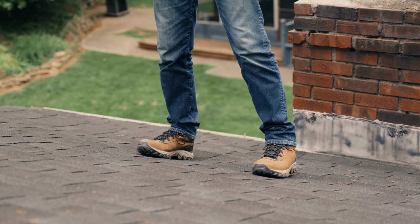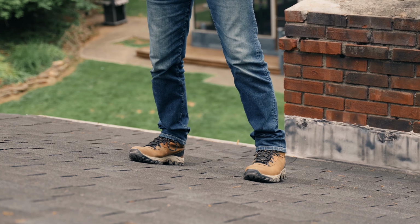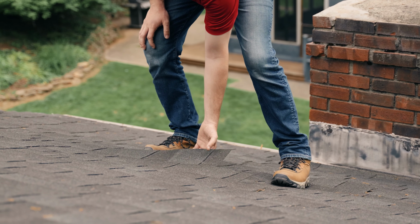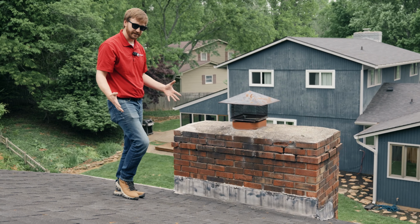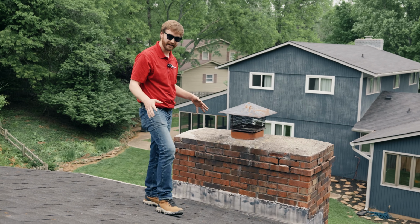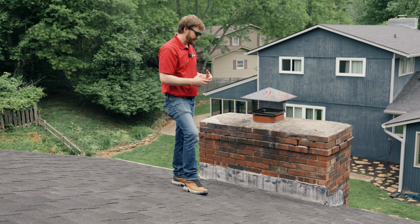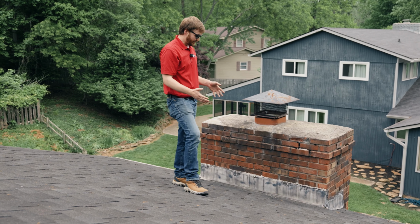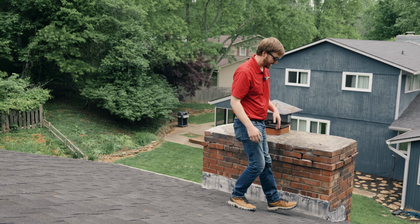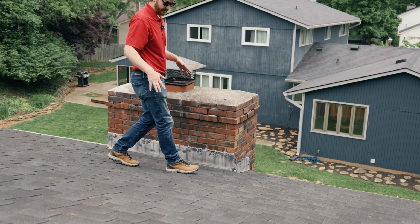I mean, there's some really bad rot right here. You probably see it bouncing beneath my feet. And that's all from water just sitting here. There's a big misconception that shingles are completely waterproof. They are not. They are just water shedding products. And when water pans up, pulls up, sits on them, they have all kinds of issues. The thought is just to avoid that water panning and separate it out, because they do have lots and lots of rot issues throughout this second story.